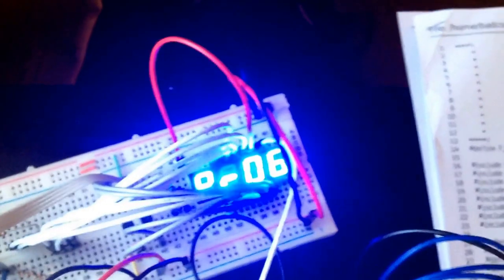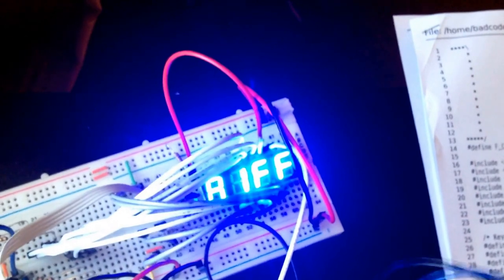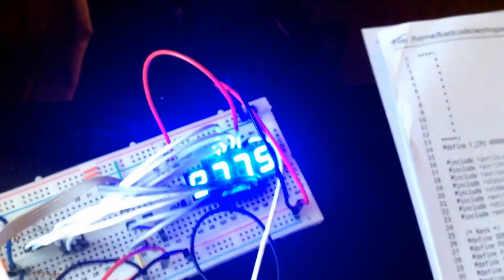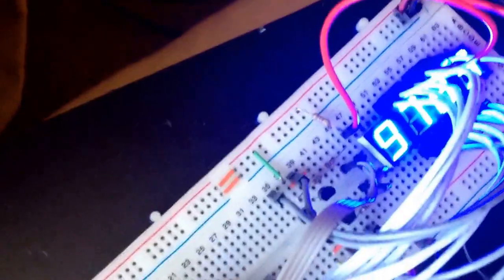You press and hold both of these buttons for about 1/2 of a second. It says prog. Now you're in set select mode to set the snooze interval. See, and it'll keep that so long as the jumper for user-defined snooze is set. If you disconnect that jumper, then it will just use the hard-coded value, which is about 6 minutes.